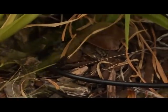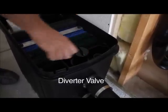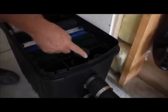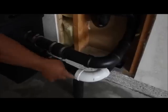Let's take a look inside this unit. The Aqua2U has a built-in three-way diverter valve. It allows you to send gray water to the Aqua2U or divert the gray water back to the sewer. The outlet that drains gray water back to the sewer is also connected to an overflow basket in the Aqua2U. If too much water is coming into the unit, the gray water will automatically flow back to the sewer.